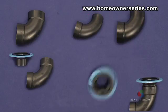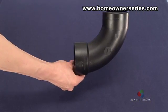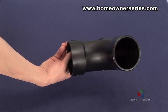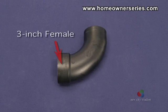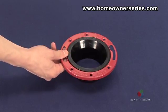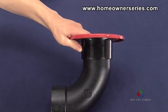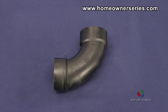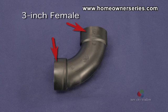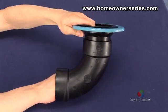The following is a list of other possible connections that can be found. This sewer inlet is called a 3-inch street elbow or street L. The name street once again implies that the connection changes from a 3-inch female to a 3-inch male. The type of flange that would fit this connection would be a 3-inch female flange. Here is a 3-inch elbow having a 3-inch female connection at both ends of the pipe; a 3-inch male flange can be inserted to make the connection.